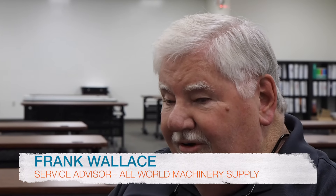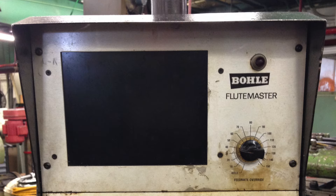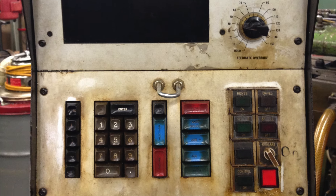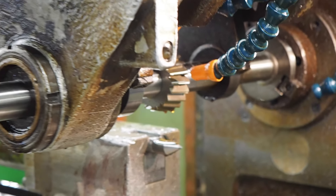This machine was down and it needed a tremendous amount of work. The machine was very rough, it's very old. The controls were toast. The electronic parts of the machines were old — all Allen Bradley components. All the boards were old, the machine was just worn out. The ball screws were worn out, the table gibs were worn out, and we could only run things so fast without the machine shaking.